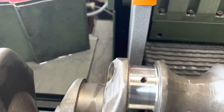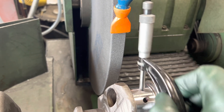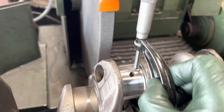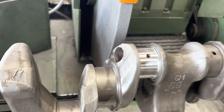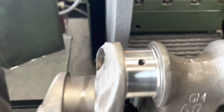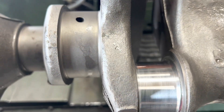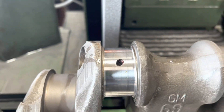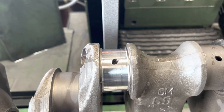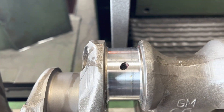Alright, we are down to 2 inch 100 here. So it might be a little big - let's see. It came out nice. Got good width here. Offset ground - got to polish it obviously. But I'm going to go ahead and torque up my bearing and let's check our clearance, because I can adjust it through the rest of the crank here. It might be easier than messing with the rods or something later. So let's go ahead and check it.